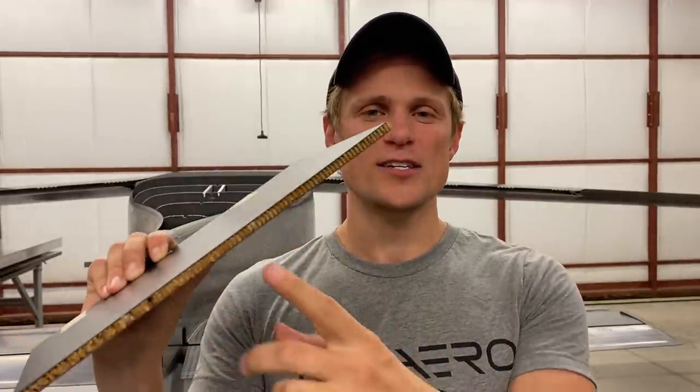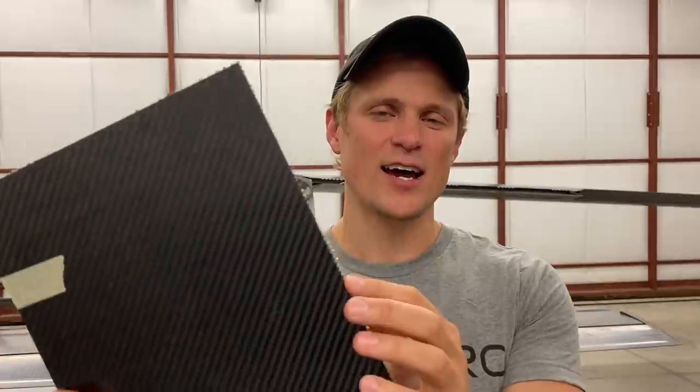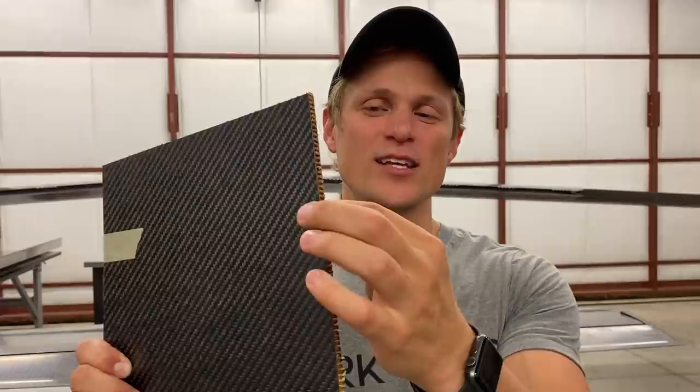In order to achieve these benefits we had to get a hold of some honeycomb sandwich panels, so we started off by going on the market and trying to buy some. This is sample number one that we got from a panel manufacturer. It has a quarter-inch aramid core and a carbon fiber skin, and it's actually made from prepreg carbon fiber. One issue was that it's not high enough temperature capability, and the other issue is it's built like a tank — it has way too many laminations of carbon fiber in the skin, so it's a bit overkill for our application. We didn't end up using this panel.